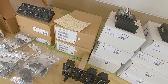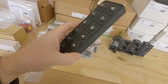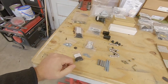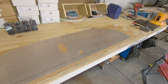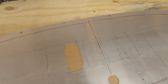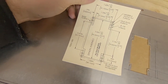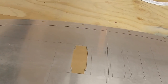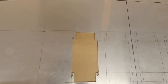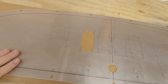To be honest I had plans to cut this panel entirely by hand, as it's not rocket science. If you're taking on an airplane build, you're not a stranger to cutting holes in aluminum. A while back I cut a rough hole for the comm radio head and it's plenty accurate enough. The fit is okay, and given that pretty much all this stuff has a lip protruding around each bit, that allows for a generous margin of error before it would be detectable from the face of the panel after installation.